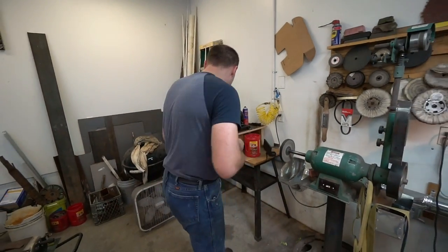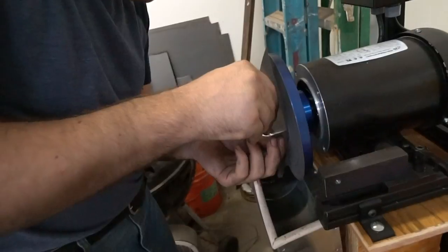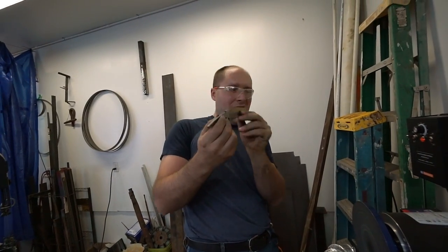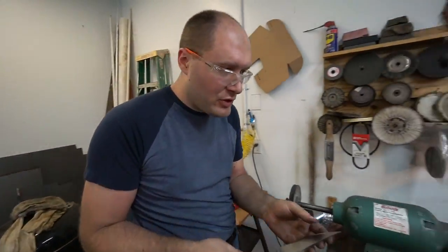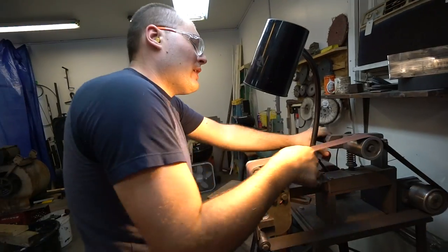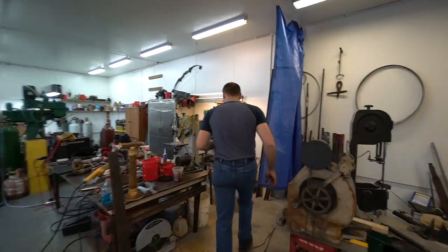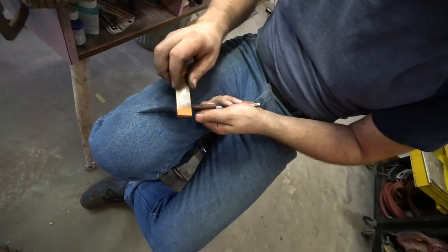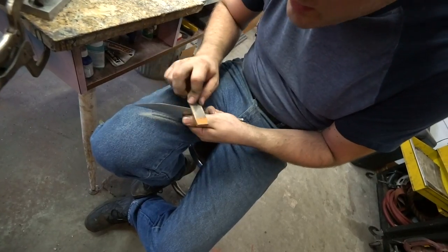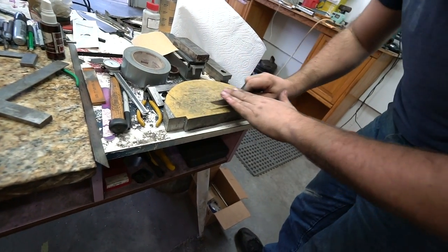Let's sand this fine first. Now that's cleaned up — now the clip, and then the blade will be pretty much done, ready for the guard fit. Clip clip clip, what am I doing? Standing belt, very very worn out 36 grit. Everything's hot, always hot. The knife's kind of sharp right now, I want to take the edge off a little bit cause I'm gonna cut myself. How about you put gloves on? I can't feel what I'm doing with gloves. This is my de-sharpening tool — it takes the edge off things like handle parts I don't want sharp. It's sandpaper glued to a block of aluminum.